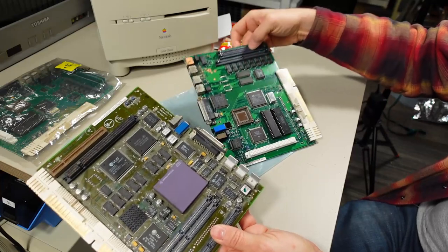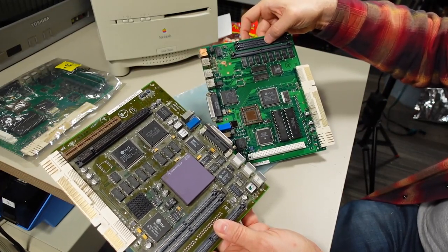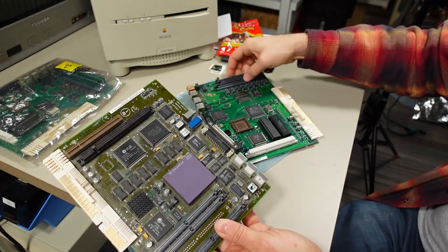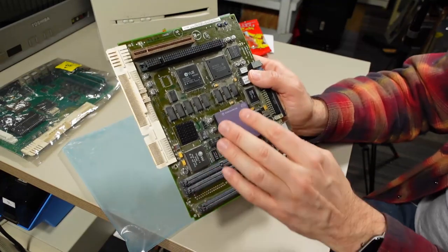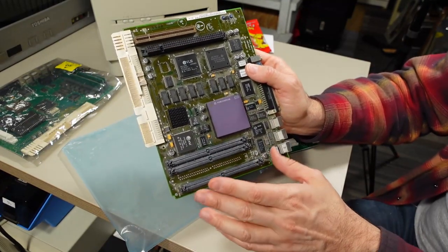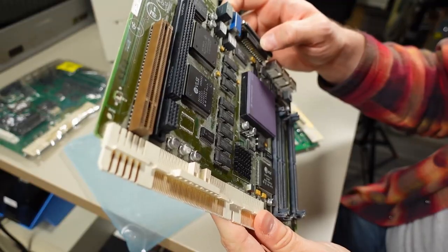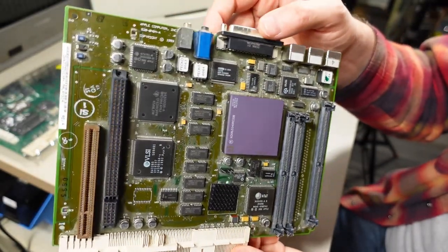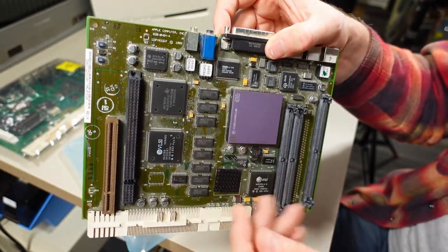That's in comparison to these, which are 8-bit each. And these memory slots, there's only two of them, you notice. That means that it's a 16-bit data bus to a 32-bit processor, so you actually have a bottleneck going on there. While I think this one has a 32-bit data bus, and then we can put in a larger capacity memory module here. I am gonna say that this board definitely is sporting its original capacitor. So yeah, it's gonna need a recap, but that was completely expected.